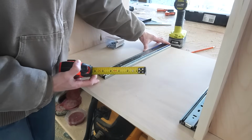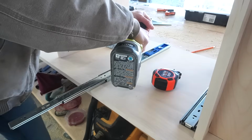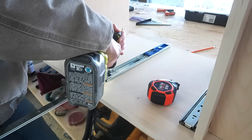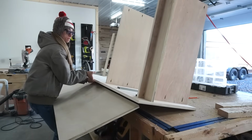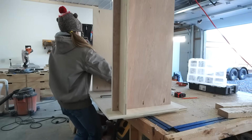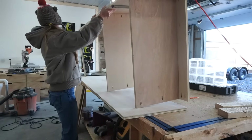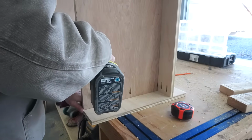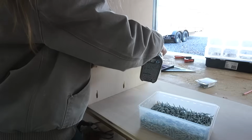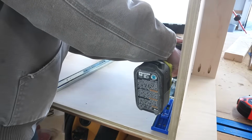While I had the cabinet on its side on the workbench, I went ahead and installed 2 drawer slides into the bottom section. I was installing inset drawers here, so I made sure to install these 3/4 inches in from the front edge of the shelves. I have a guide to installing drawer slides that I will link below for details if you're interested. Once the slides were in place, I flipped it over to attach the second side panel the same way and also the 2 drawer slides at the bottom.